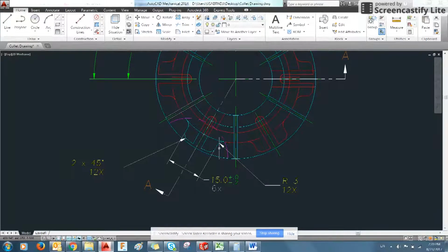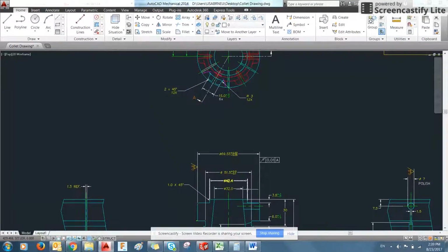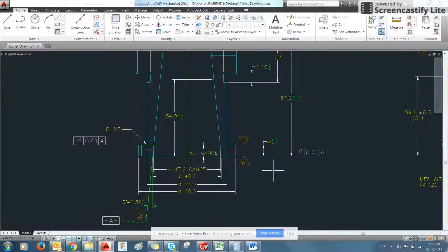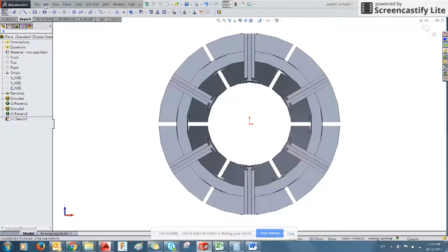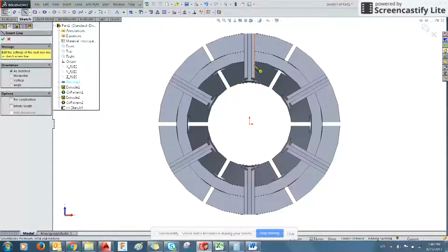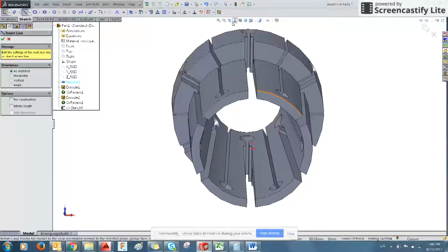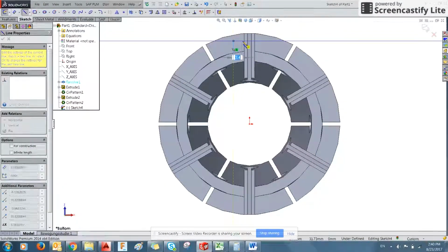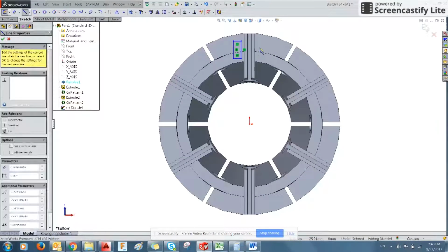So we have 15 millimeters across, centered about that bottom cut. It's 8 millimeters tall, and it sticks out from the face. So we can start drawing here, and it is oriented to these bottom cuts. The feet straddle these cuts. So the easiest way is going to be to simply draw two squares.